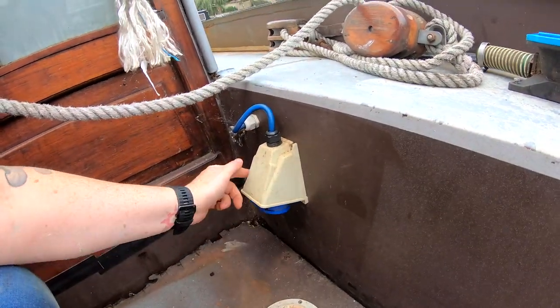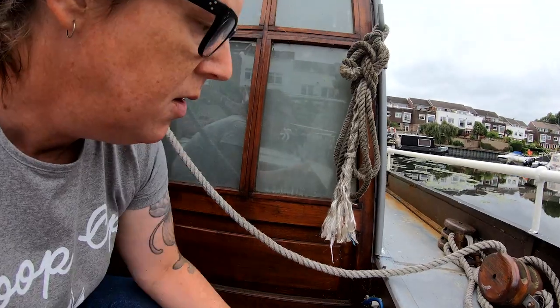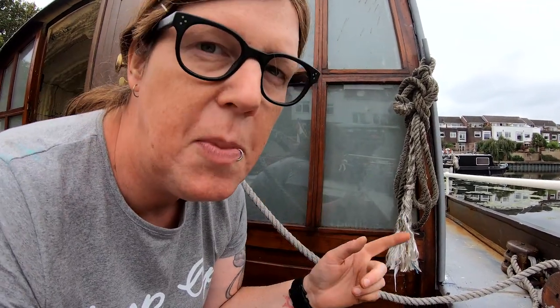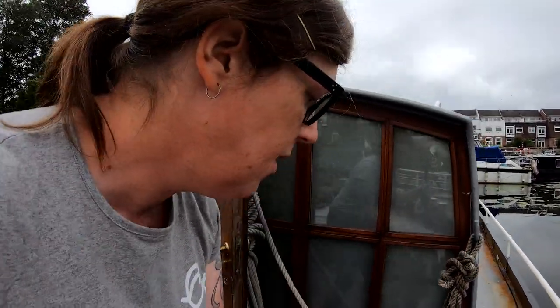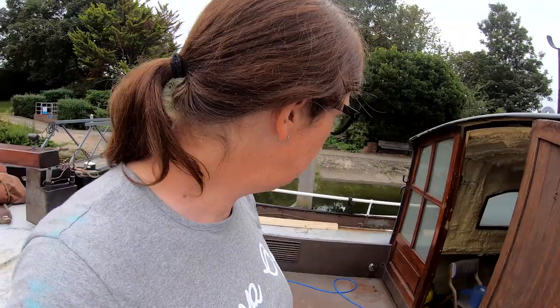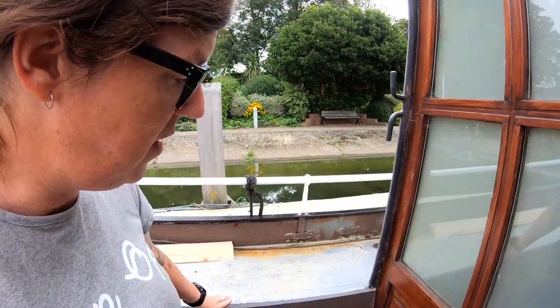So there's one more thing I wanted to show you, and it's a really lovely thing. First of all, some context. This is the shore power socket, and it is a 230 volt 16 amp socket, so it's the old 16 amp type. I say old because I'd actually quite like to upgrade to 32 amp. Where I am, the shore power isn't 32 amp yet, but it might be, and it might be someplace I visit. So this is going to be the temporary system, providing power for just now for some sockets indoors, but the new system will be connected to this socket.